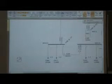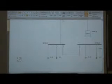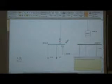Well, as we looked at load flow, I wonder what happened to the short circuit level, because I've got a little time now I can look at it. So I'll click on short circuit, and I'm going to go on phase A, because I've got to pick some phase, and I'm going to go three-phase fault. They usually fault the line to ground, but I'm going to go three-phase, and let's see if it'll tell me anything. Short circuit, all buses. Okay, I have to pick a bus. I'm going to pick that bus, and okay, we have 26,000 ampere short circuit three-phase.